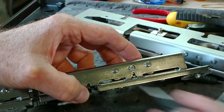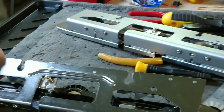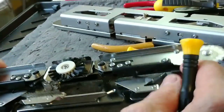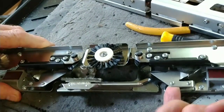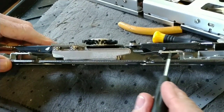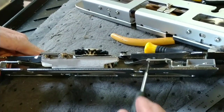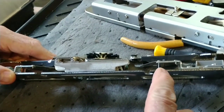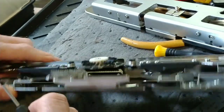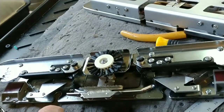With these particular sinker plates, you have to be very, very careful because these are adjustment screws, but if you bear down very hard without getting your finger up underneath them, you're going to bend them — it flexes quite a bit. If these were bent and they were too close together here, they have to be this distance on both ends.